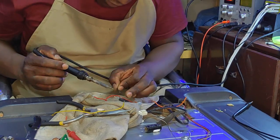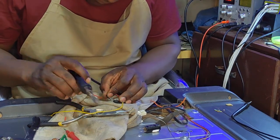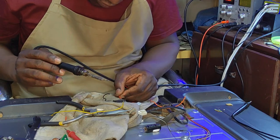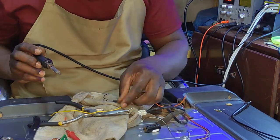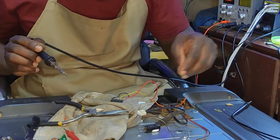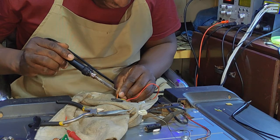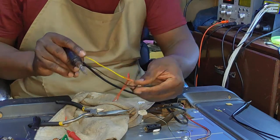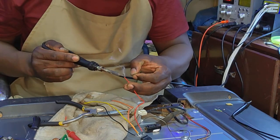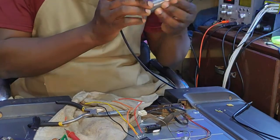So it means the rectifier bridge was not working. The switching MOSFETs, which is our chopper, was not working. The big cap, I don't know what will happen with this TV. Seems as if everything is gone. We do have some boards for replacement, but I'm not here to replace things. Actually, I'm here to fix things, you know.